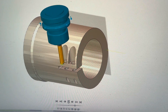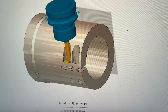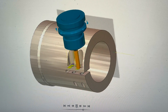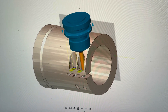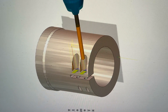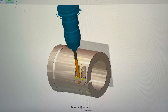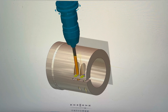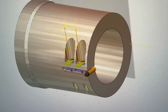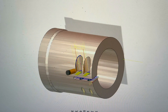This is one of our outboard spindle adapters we make for the Haas TL lathes. This particular one is a clamp style and is used for the 2016 or newer A25 spindles. This is used to attach a 5C collet chuck to the outboard side of the spindle, which in turn holds our live swivel coolant shaft to deliver high pressure coolant through the barrels when chambering.